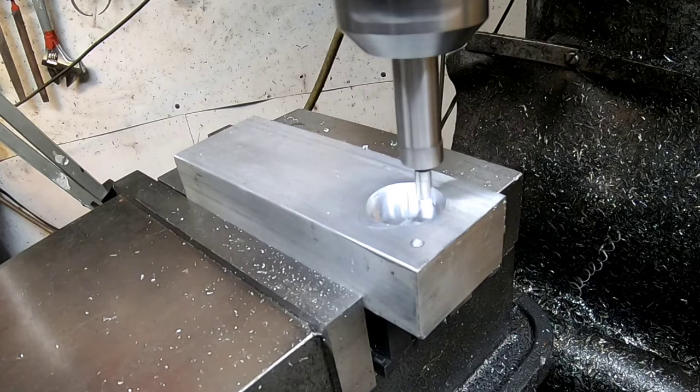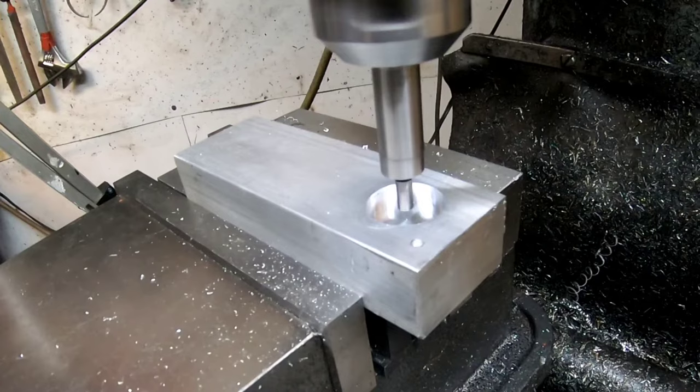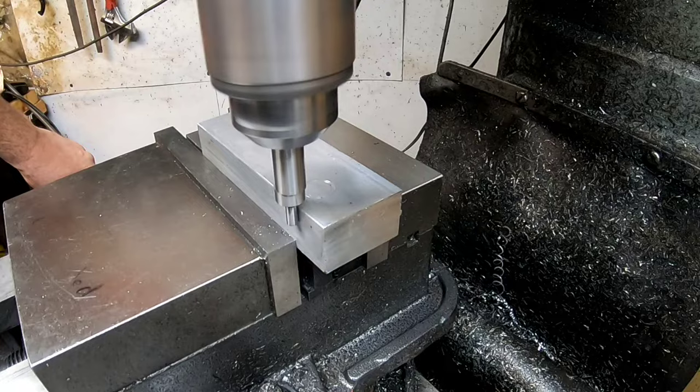Remember: in all cases of finding the edge of something, this is dependent on whether you have a burr or grit in there — everything has to be cleaned up really nicely. You also have to expect small variables like a taper or an oblong hole and compensate accordingly, especially if you're doing something like a cylinder.